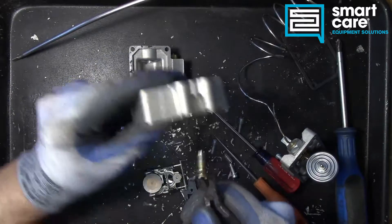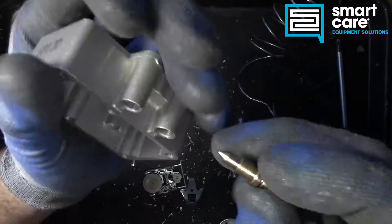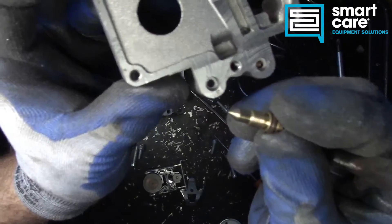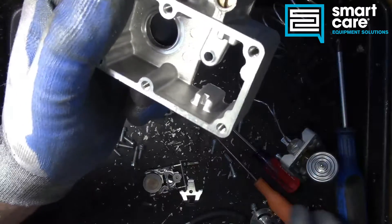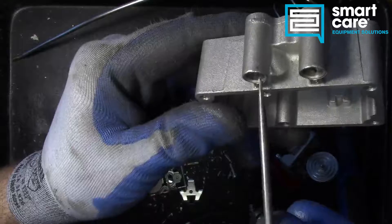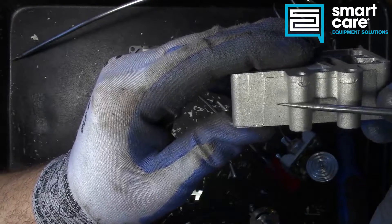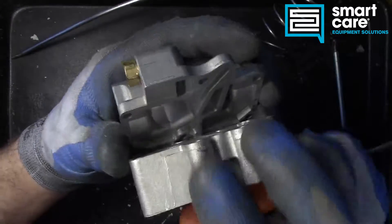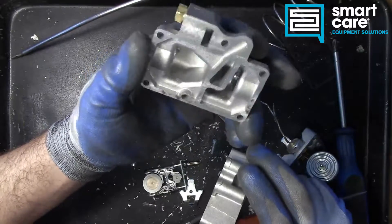So it is very similar to a carburetor jet — you've got this tapered portion going into a fixed-diameter hole. As you back this out, you're able to flow more gas around it. Gas feeds in from the body here on this port, goes into the bottom part of this bore, and comes out right around in here. That brass piece, depending on where it's positioned, controls the flow rate through this small hole, which then lines up into our pilot passage.